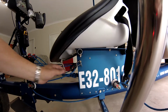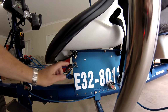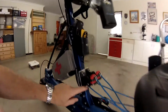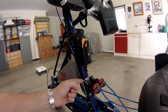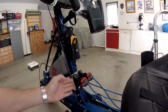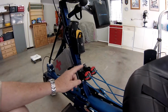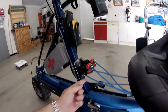But what I've done is I've added another pulley. This is a YPF pulley, but any good marine pulley will do. A D-shackle, which I've safety wired, and the line goes through the D-shackle up to my in-flight trim system. Now, I've just added a plate. It's an aluminium plate, but anything will do. This is a standard Riley fitting. This brand name's Riley. You can get other brands, as long as it's a good marine type brand, that will be okay. It comes up through a pulley.